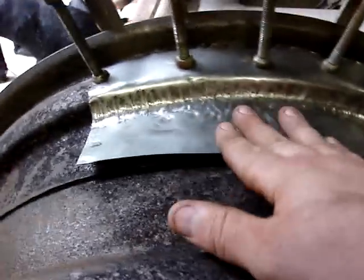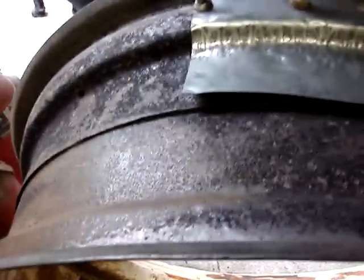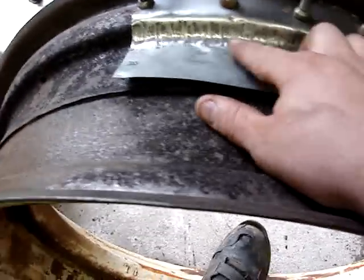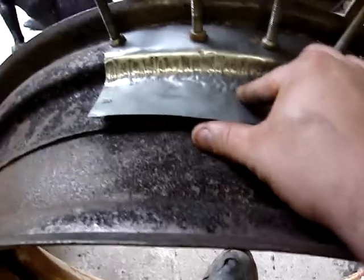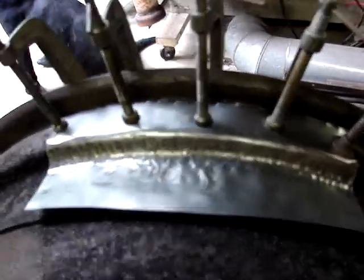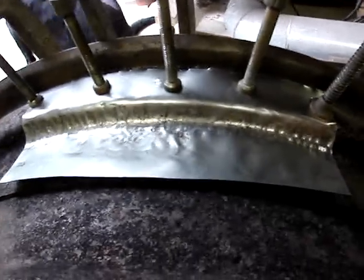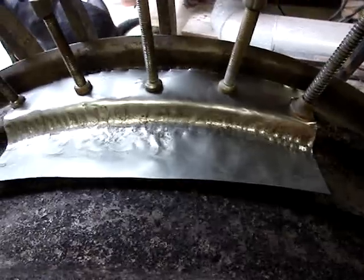It's not the prettiest looking thing, but I got the basic shape started here. I think I can flex it in enough when I tack weld it on that it'll hold up the shape right. Metal doesn't like to do a double bend on a radius — there's a gentle 90 here and a gentle 90 here, but there's the curve of the rim this way. It doesn't like to go that way, so it takes a little persuasion. All I really did is use a wooden block with a curve on the end of it and a ball peen hammer, and that's it.